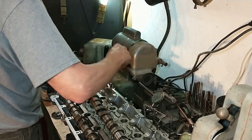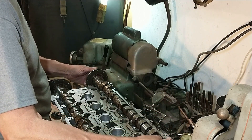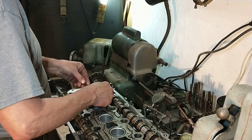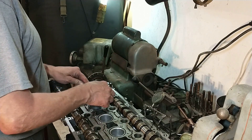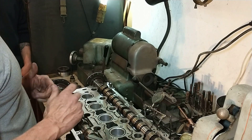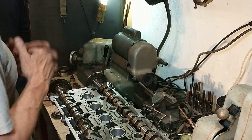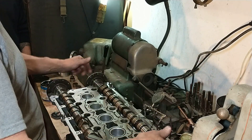That's the basic gist of it. Let's do one more real quick. That one ends up just about perfect — 0.381. So we are ending up with exhaust valves where the clearance is on the snug side, which is what I prefer. Makes for a quiet engine, gets the maximum amount of lift, but we still have enough clearance that when the parts heat up and expand, we maintain adequate clearance. That's why exhaust clearance values are larger than intake — it's simply getting hotter.